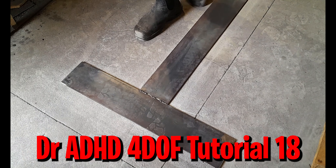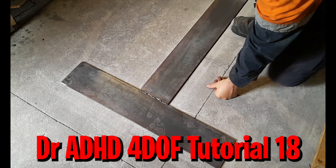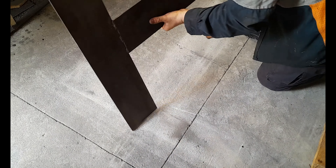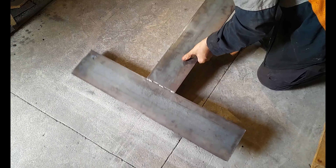Because of the nature of metals when you weld this — I'll give you an example — this is what you're going to get. It won't sit flush because it's warped from the welding. What I recommend: take a piece of timber, put it right in the center, and do that a couple of times.